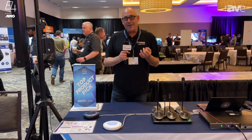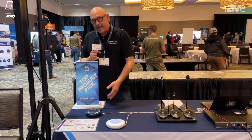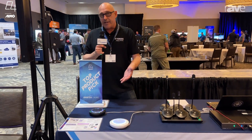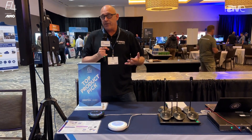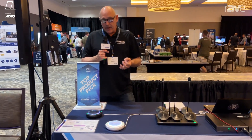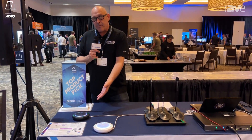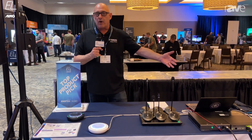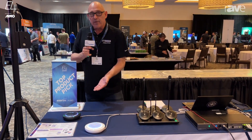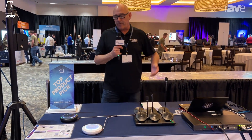But wait, there's more. With our new 2.0 upgrade, which came out a few weeks ago, we've now added low latency mode to these microphones as well. So now you can use these for voice lift applications, which you couldn't before. We've kept both channels active, so I can use these mics with our controller using the DSP within the mic for Teams and Zoom calls, and then also open up Dante controller and route the low latency signal out to amplifiers within the room for mix minus and voice lift.